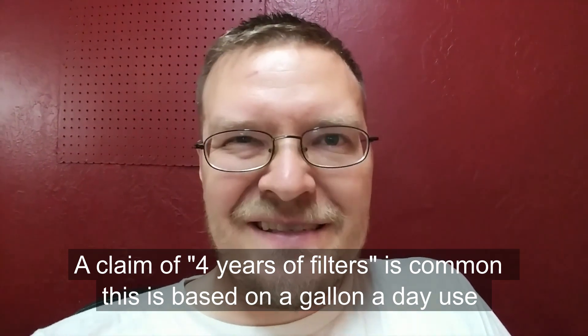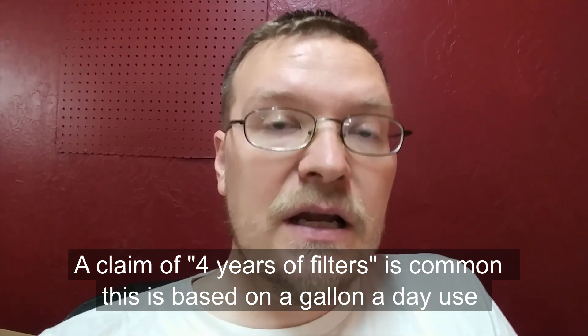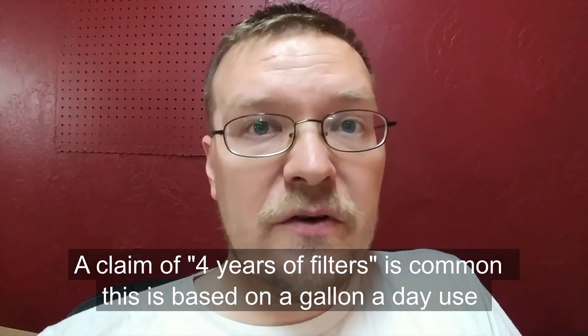Something else worth noting: there are a lot of pre-built kits on eBay that run just a little bit more expensive than this. They come with a whole lot of filters and really seem a lot easier to set up. That may be true if you don't do DIY stuff, but the total cost of this setup comes out to about two cents a gallon averaged over a year if you're doing 300 gallons a month. The total cost of running one of the pre-built kits comes out to about six or seven cents a gallon. They do tend to use universal cartridges, but you're going to be replacing cartridges you really don't need for a fish tank. The extra cartridges may make the RO filter last 20% longer, but they cost enough that it completely offsets the savings on replacing the RO membrane less frequently.